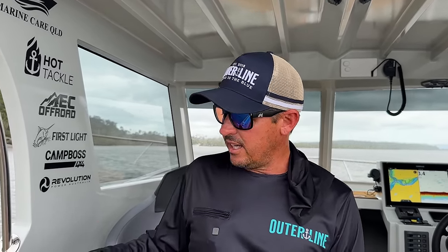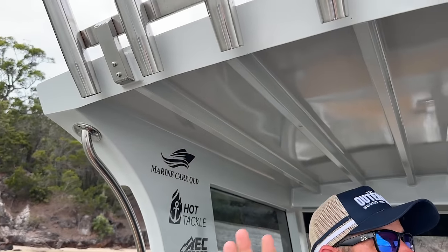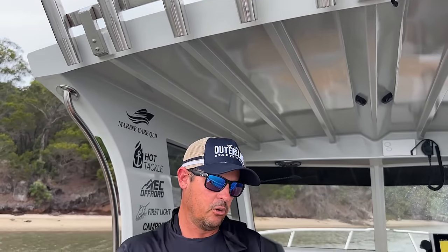And then everything he said was lanolin greased, which I know now it is because I even pulled the speaker screws out. You would have seen that, and they had lanolin grease on them. So yeah, what I'm gonna do is get that white gasket stuff that I used with the rod holders that you've seen, and I'm just gonna pull all this stuff off and put it between, just so I don't ever have to do it again.